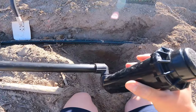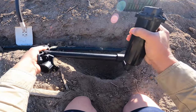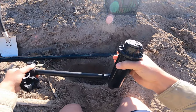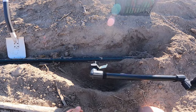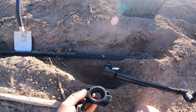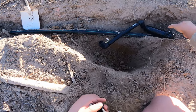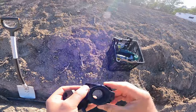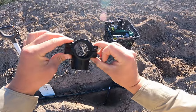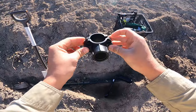The assembly will sit in the ground like so. With all these elbow joints, in the future we can adjust the position — spin it this way, spin it that way, anywhere you like. If you want it to go lower you can, and if you want the sprinkler to sit higher you can also do that, for example if you top-dress your lawn. To connect the fitting to the poly pipe itself we use a saddle. You could use a T section like we used earlier, but those T sections are pretty expensive, so we opted for saddles — they're cheaper, and they essentially do the same job and are probably easier to work with too. They clamp around the poly pipe with a seal, sitting nice and firm on the one inch poly pipe.